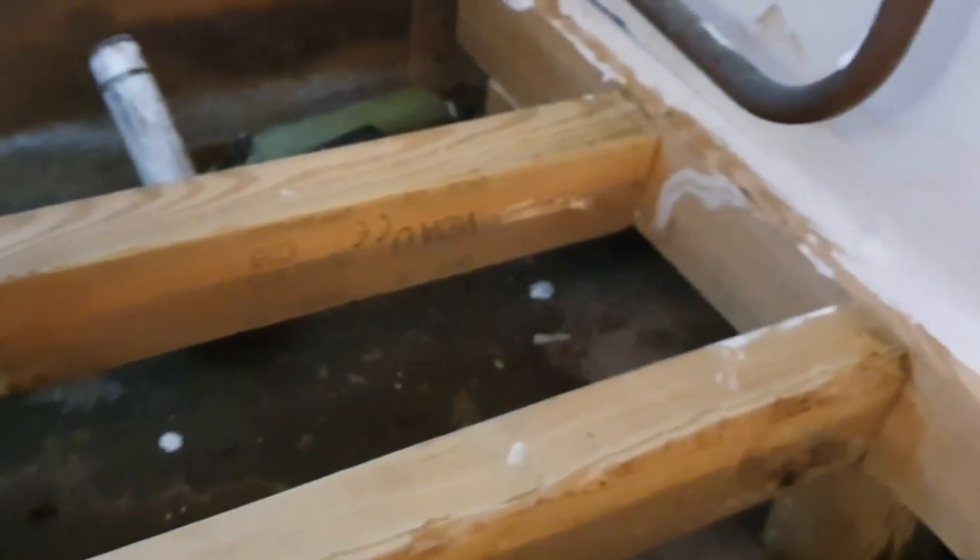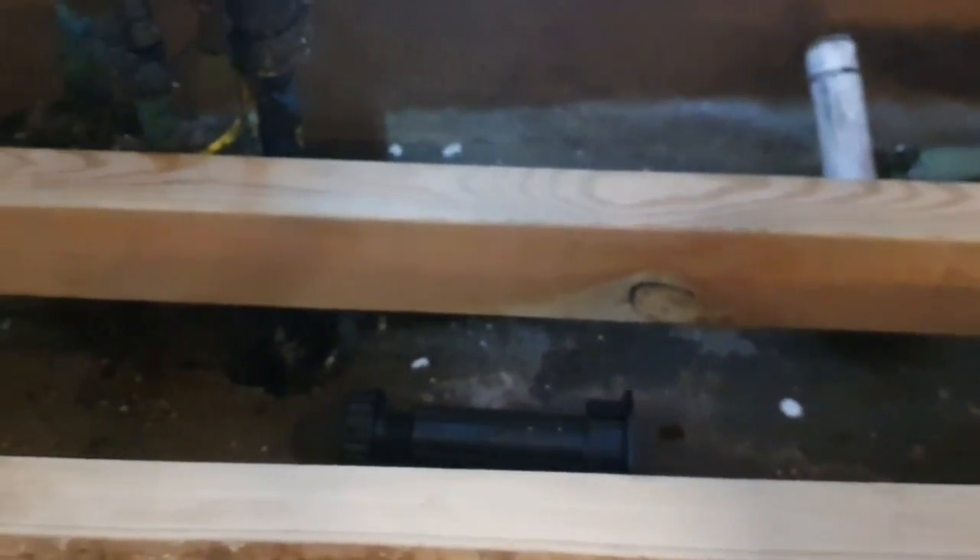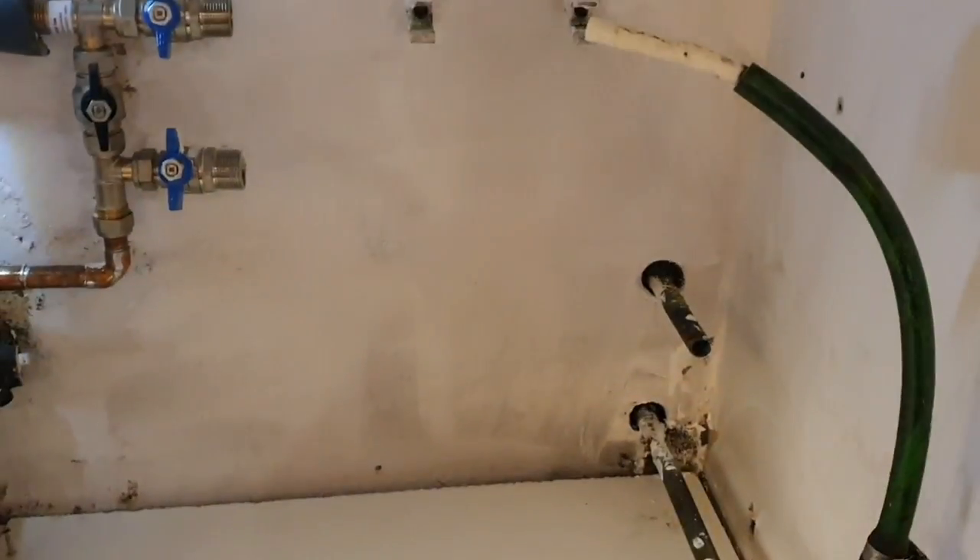With the plumbing now fixed, I'm going to start making this frame. I used two-by-one tanalised timber, and a pocket hole jig is used to join the timbers, which makes them really strong — it'll be a frame for life. I'm then going to use 16mm furniture panels to lay on top of these timbers to make a really nice sturdy base, because these water softeners are around about 25 kilos when fully loaded with salt, so we really need a strong base.